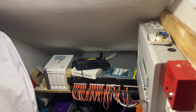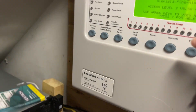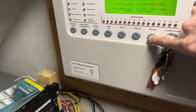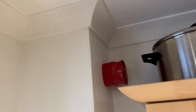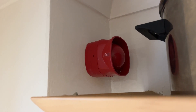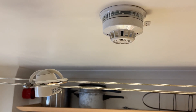The first thing I'm going to do is activate the 'this is a test' message across the voice sounders. Put the key in like that and then push function, which is mapped to activate the 'this is a test' on the Discovery voice sounders. So here we go. 'This is a test of the fire alarm system. Please do not take any action.'